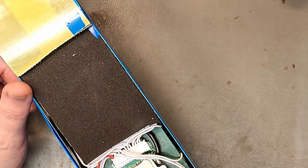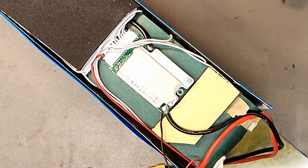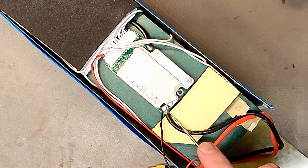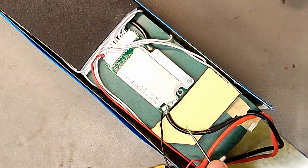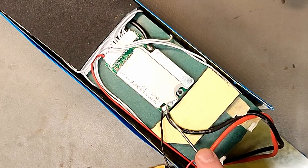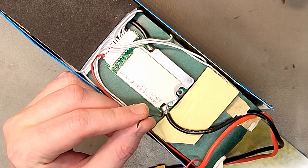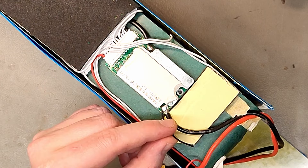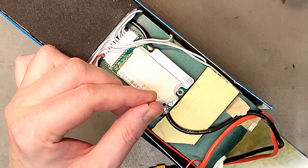There is something wrong with this battery — and it's so freaking unnecessary, we've seen it so many times. This is a BMS that has one port for charging and one for discharging, and they did not connect the discharging cable in the discharging port. No, they connected it in the charging port. And they have these ultra thin cables — as thin as the T wires, like 24 AWG.